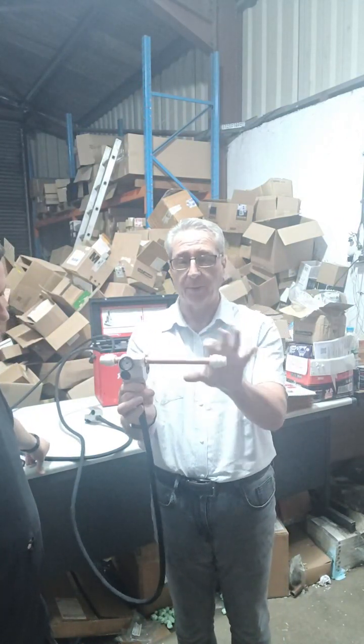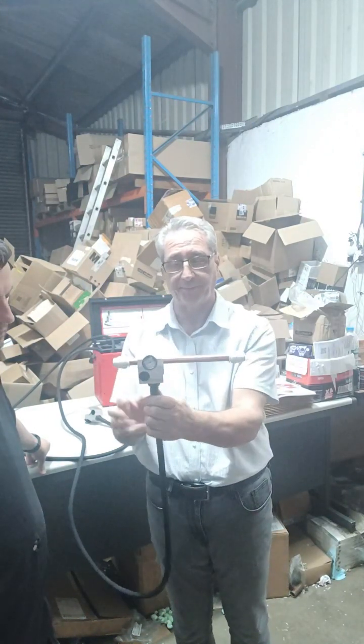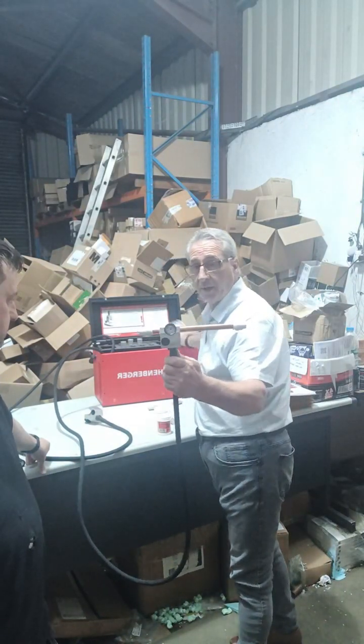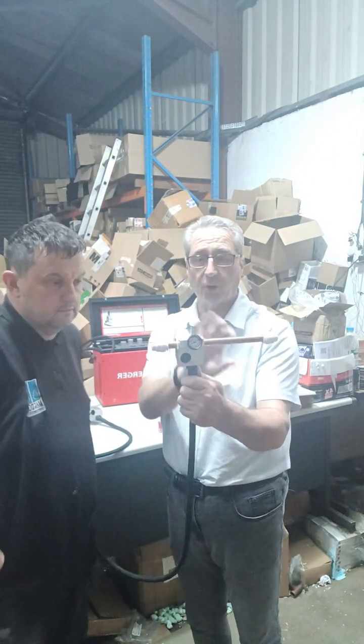If you had a leak there, you would put the two on, freeze it, cut it out, and then replace it with another fitting. So basically what I'm going to do now is turn it on, and in about 5 minutes' time, that should all be frozen.